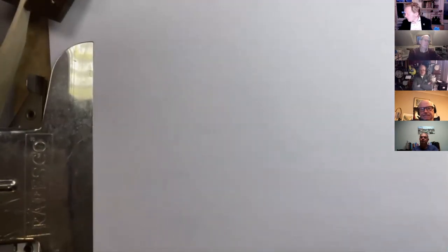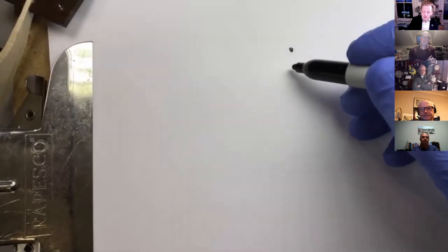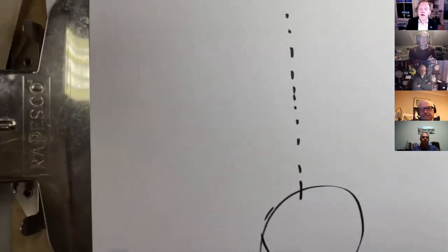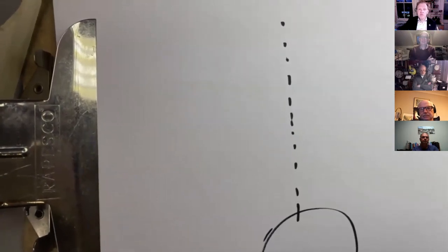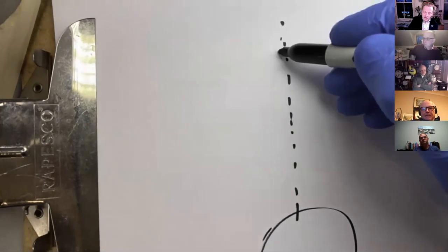So again, we're kind of going over a little bit of old ground here, but let's just quickly take our pendulum, which normally, let's call that the line of centers or the point of rest. Move it up a bit. And then if you were to start the pendulum swinging, but not giving it a big push, just start it with a tiny little bit of impulse and slowly build up amplitude to the point where the clock is just escaping, we would call that escaping arc.